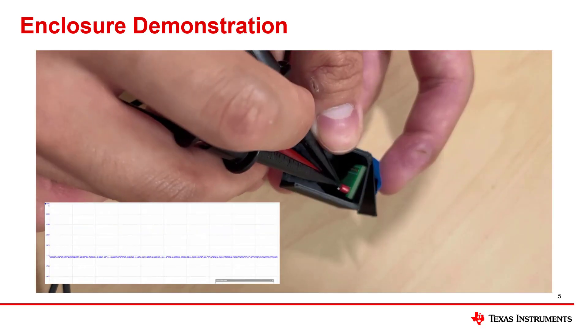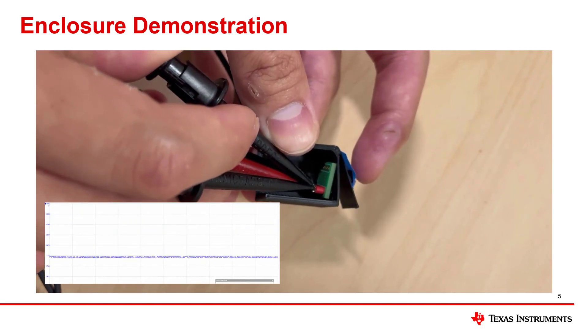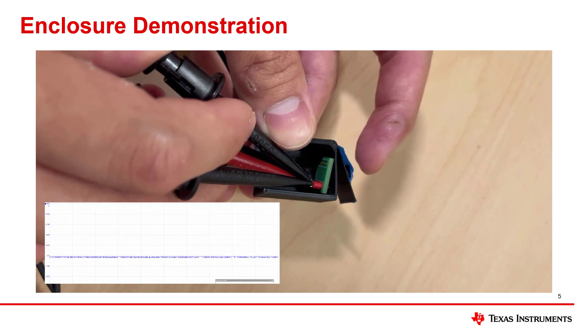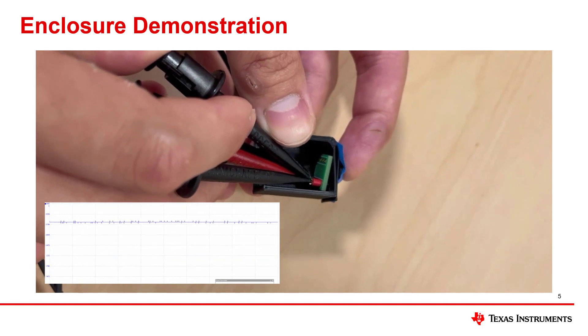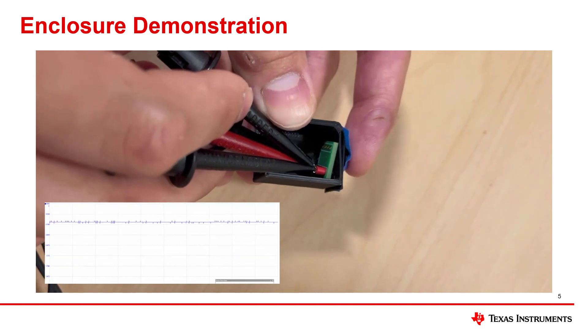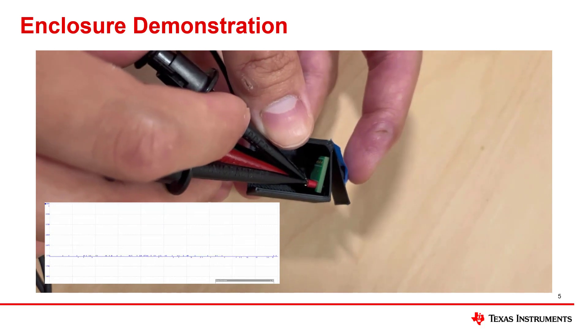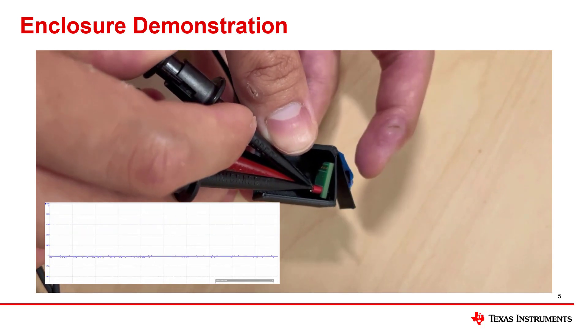As a quick demonstration, with the magnet mounted onto the flexible arm, when the robot collides with an object, the flexible arm will bring the magnet closer to the PCB. If a linear Hall sensor like the DRV5055 is chosen, the output voltage will increase linearly based on the magnetic flux perceived from the magnet.